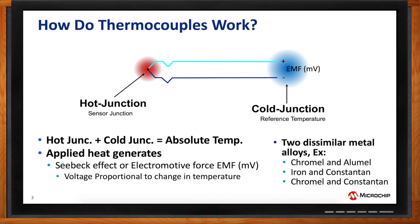The point of contact for the two wires is where the thermocouple is placed into the harsh or high-temperature environment, whereas the cold junction is where the measurement is being conducted, and that is usually at room temperature. The sum of the cold junction and hot junction temperatures gives you an absolute temperature reading. The voltage that's measured is called the Seebeck effect or electromotive force. Thermocouples don't need any excitation — current, voltage, or supply — they are self-contained and generate voltage proportional to changes in temperature.